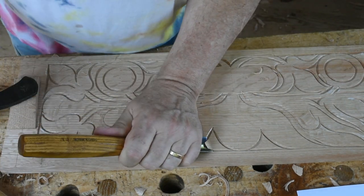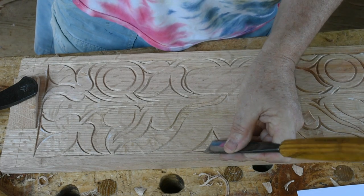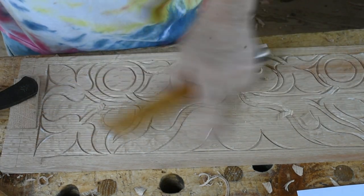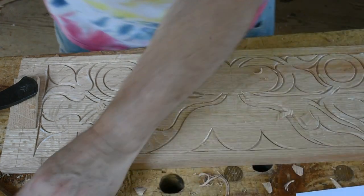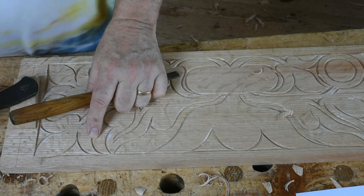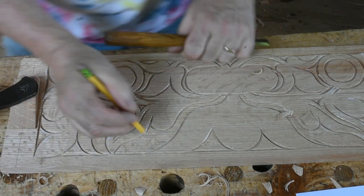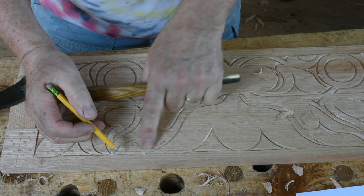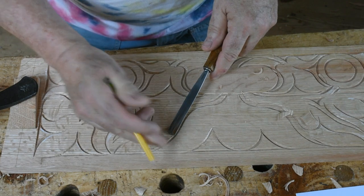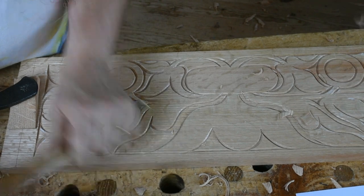Up in here there's enough room for that larger tool as well. Working with the smaller tool now, I can run down that V-tool line because the fibers are here — if I run this way they're all supported as I cut across them. I don't want to run the other way because there's nothing supporting them behind and they'll tear. So I cut right down to the depth of that V-tool line.